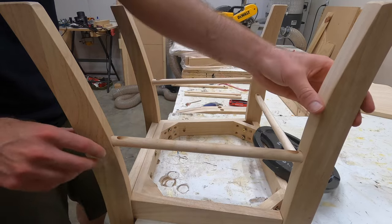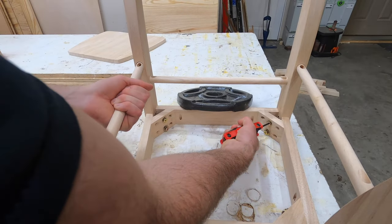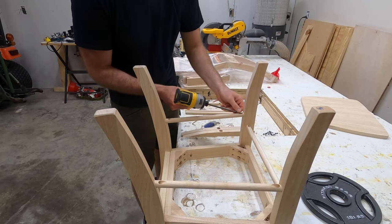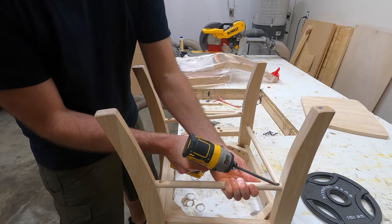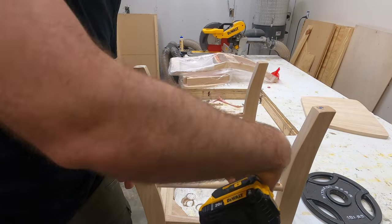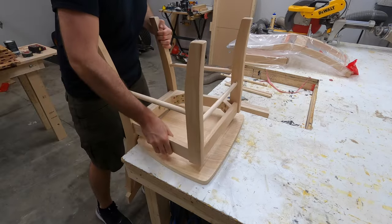Since the chair is upside down, make sure that you have those facing up — or if you're somehow doing the assembly with the chair over your head, then you want them facing down. Next, we just use the screws supplied with the chairs to bolt those support spindles into each of the legs, securing everything together. And since those pocket holes are facing the bottom of the chair, they will never be seen after the chair is completely finished.